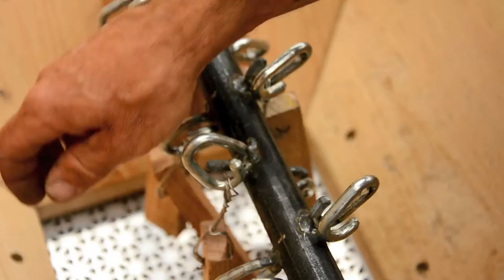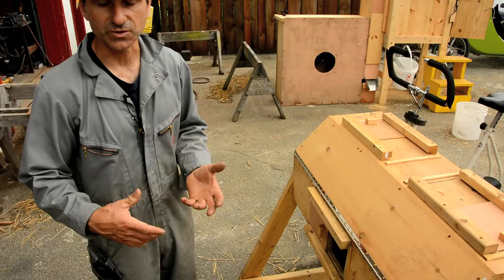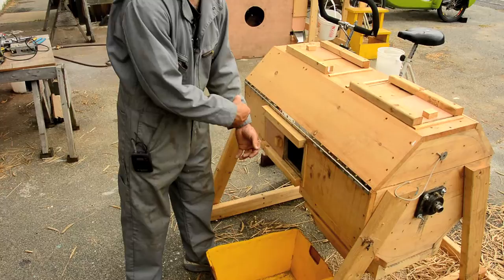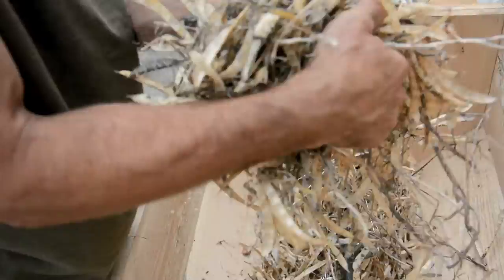The one other possible mode of use — which unfortunately we haven't had a chance to test — is if you get rice, wheat, or rye harvested with a grain cradle and in bundles. You'd open this window, concentrate a bunch of flails right there on the shaft, and someone would just hold the sheaves headfirst into the thresher until they were de-seeded. It's very easy to know if it's working right: if you're getting seeds out the bottom it's working, and when you're done you can inspect your seed husks — if you don't find any seeds, the thresher is working beautifully.